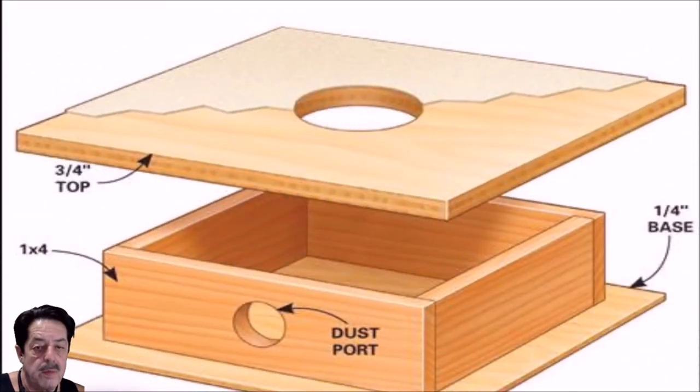Now here's the one that I made. It doesn't have to be quarter inch or three quarter — I just had some one-by pine laying around and I created this box. I drilled holes, used some drywall screws, tightened it up with a little glue, and set it on top of a piece of half-inch plywood. I used half inch for the top and used the hole saw to cut both holes — one for the dust port and one for the top. I can clamp it with this overhang all the way around, clamp it to my drill press base, come down with the drill press, lock it in place, and I've got a little drum sander going.